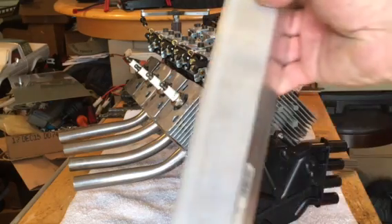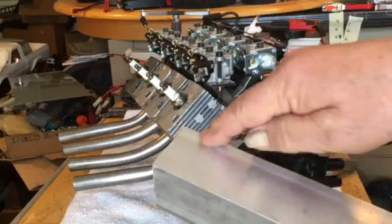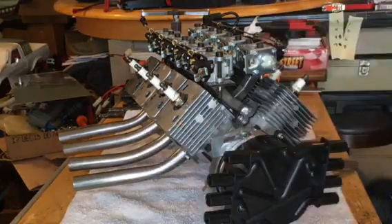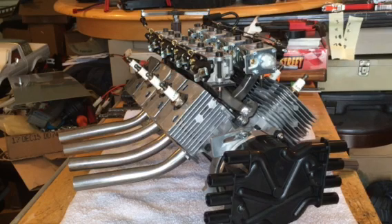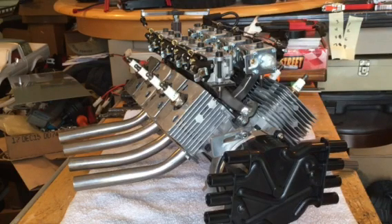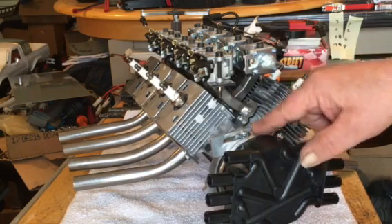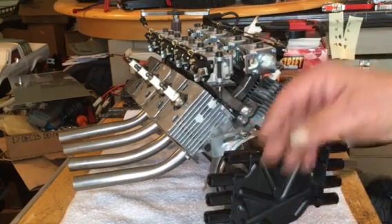As far as the configured setup, it's just a two-inch by eighth-inch piece of aluminum. I set the head gaskets on here where they needed to be, cut out the holes, put the two-stroke ports in them, and bolted them right through. I cut one end off each crankshaft, put the counterweight together, and welded them to tie up the space so it's smaller. For spark, I decided to use a distributor off a '99-2000 Chevrolet pickup truck 5.7 liter — I chose it because it has a nice flat cap, it's real short and kind of small, and the spark plug wires come out the sides.